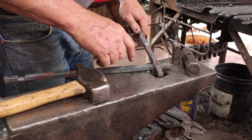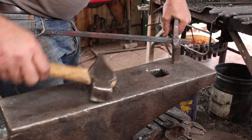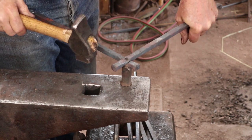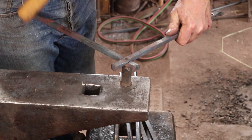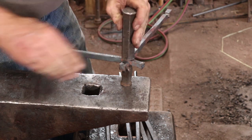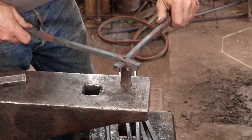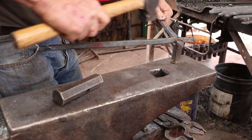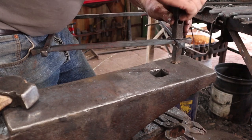It's a good idea to snug it up with a monkey tool if you have one. Typically I set three-sixteenths rivets cold, and anything smaller than that cold. Anything larger than quarter inch I do hot; quarter inch I kind of flip a coin and see what I feel like that day. Let's see how these do cold. Make sure it stays in the rivet header — if it bounces out and you hit it again, you might end up putting a little lip on there and you don't want that. But that's a good solid rivet — that's not going anywhere. We'll repeat the same steps with the opposite corner, then put the two halves together and finish assembling this.